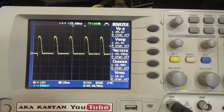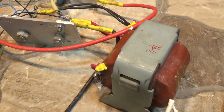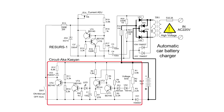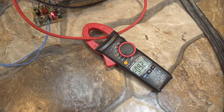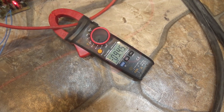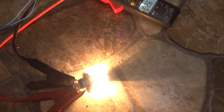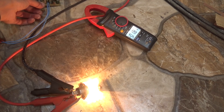Due to the pulse mode of operation, the efficiency of the current is quite high. But still, power components need a heatsink when using the device at high currents. The next part of the diagram is the automation system. It is important to note that if the switch is closed, the automation turns off and you just get a power regulator. In manual mode with automation disabled, the charger can work without a connected battery, but there are no protections in this mode. This mode is used only to check the operability of, for example, a light bulb or the device itself. In this case, current regulation works, but worse than with a connected battery.